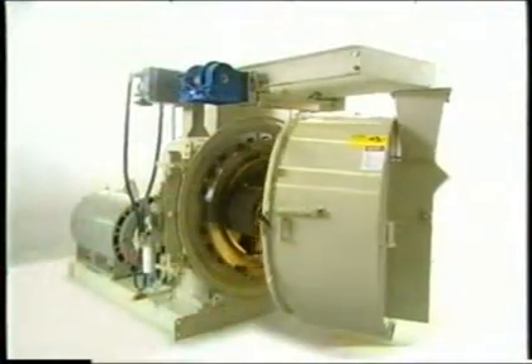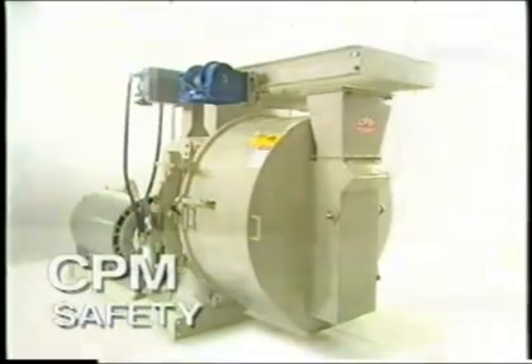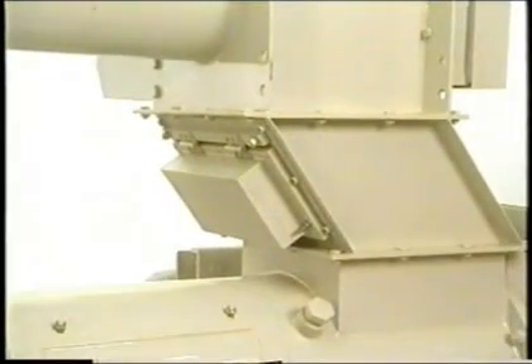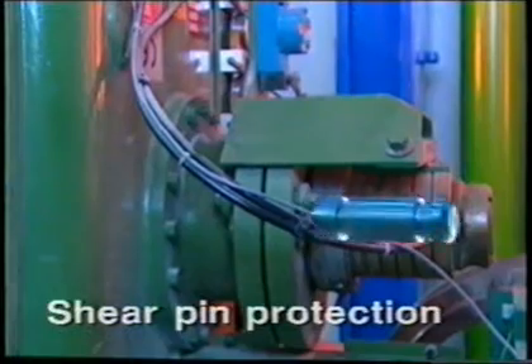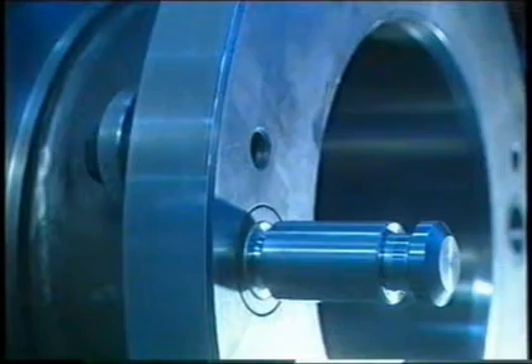CPM pellet mills give you maximum quality and maximum safety. A strong magnet will prevent any steel object entering the pellet mill. All of our machines feature shear pin protection — these pins protect damage to the die and rollers by breaking when put under overload conditions. Shear pins are quickly changed, assuring minimum downtime of equipment.